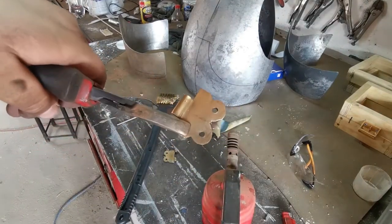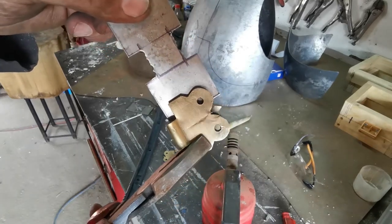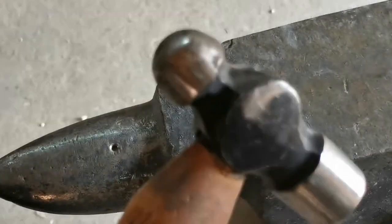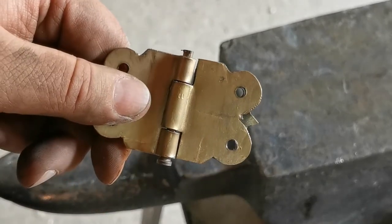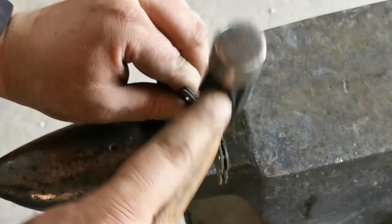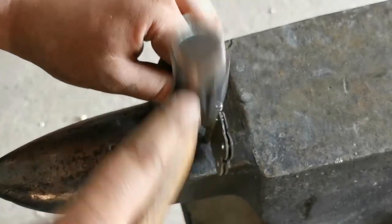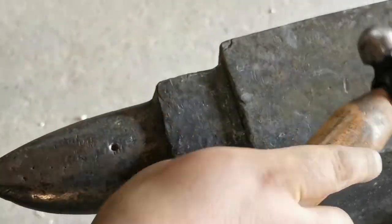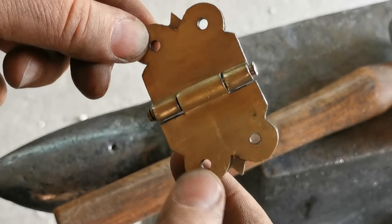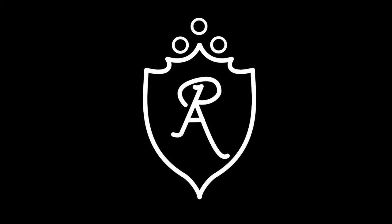And there we go — look how nice that looks! Compared to the two different colors, we have somewhat gold hinges. Using the ball peen part of a ball peen hammer, with our hinge there and the nail in the middle, leave a little bit on the top and we're going to peen it over. And there's our hinge — the nail can't come off and we've got a nice brass hinge. There we go.